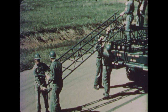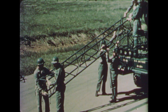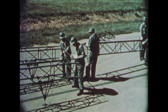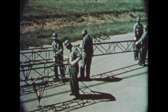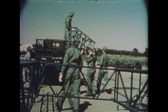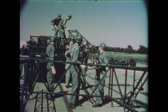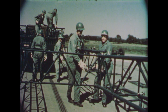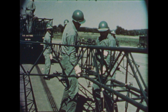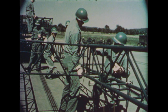All sub-assemblies of the frame have reasonable weight and good balance for ease of handling. Spreaders placed at section ends keep the frame parallel and maintain stability. The other number two section is lifted from the erector truck. Both number one sections will now be held parallel by a spreader and supported by jacks. Crew members hold each section in a horizontal plane and in a parallel line until the spreaders and jacks are attached.